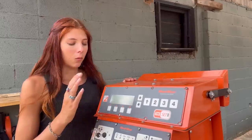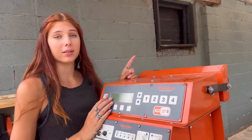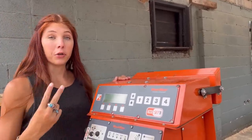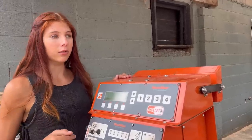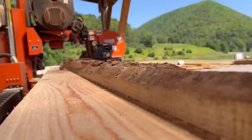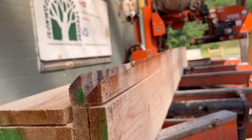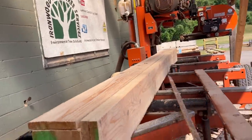The Simple Set measures from the top, but why is this all important? It matters when you are deciding how you want to cut the flitches. There are two ways to do it: you can either cut the flitches as you're cutting the cant down, so you have your cant already squared up and then you put the flitches up against it and cut the cant with the flitches together — that is one way of doing it.